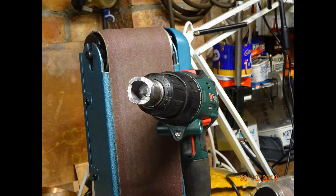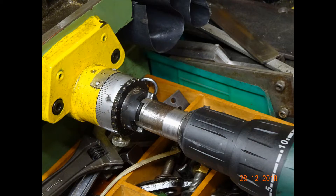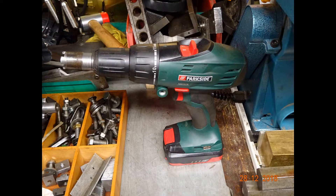This is the driving dog for the feed screws on the milling machine. The driving dogs or couplings, if you want to call them that, do not permanently attach to the machine screws — they just slide on and off, so it's a matter of seconds to actually engage the drive or disengage it.